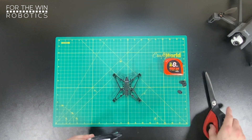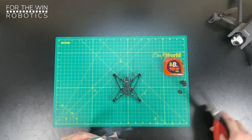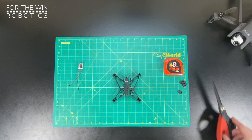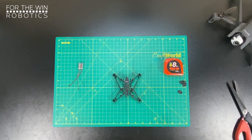The other pack is two motors each. Be careful when you're cutting these because they are corded. So two C motors right there, which rotate clockwise, and two A motors here, which rotate anticlockwise. So the first step basically is knowing where the motors go.